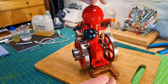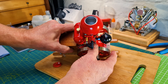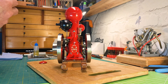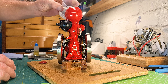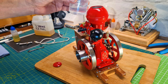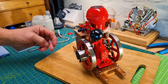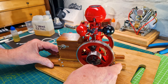Obviously there's the hopper — if you fill that up with water it acts as the coolant for the engine. I'll do that now while I'm talking about it. Just fill it up to about halfway — that should be okay. I'll leave the cap off actually, because when the engine is going it does jump around a bit and the cap will likely jump off anyway.